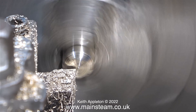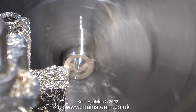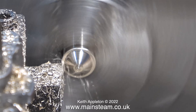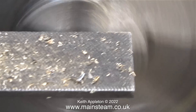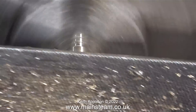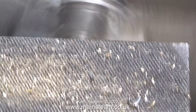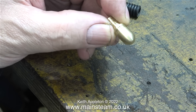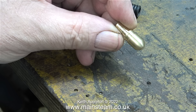The next part of the job is to round the end, and again I'm doing this freehand. I don't have a ball turning tool, so I'm just using what I would term the etch-a-sketch method by turning both handles simultaneously to form the rounded end of the part. Once I'd got a nice curvature on the end of the piece of brass, I used the file to further smooth it out. When you're filing in the lathe, keep the file away from the chuck and make sure the file has a handle. After the filing comes the emery cloth, followed by a piece of scotch brite. I turned the grooves in the part that goes in the pipe to hold it in position; the other groove is just decorative.